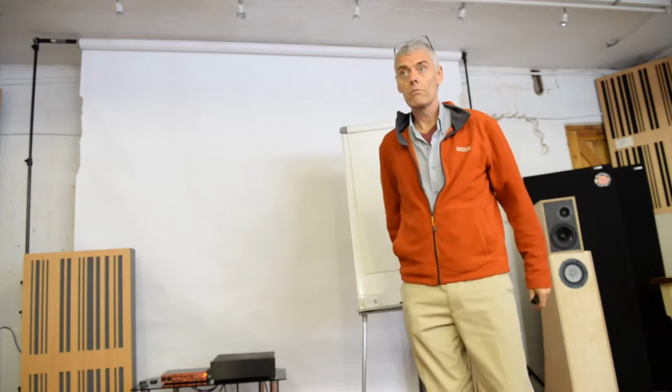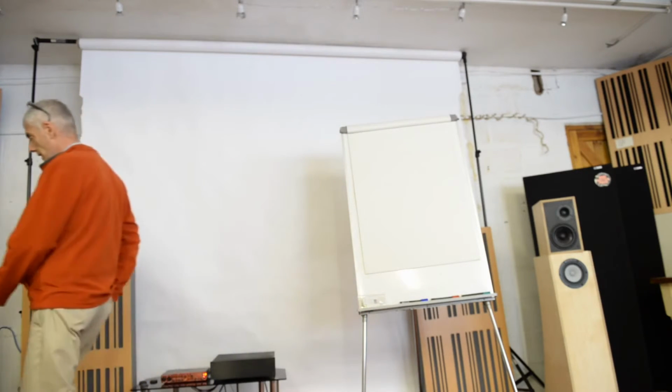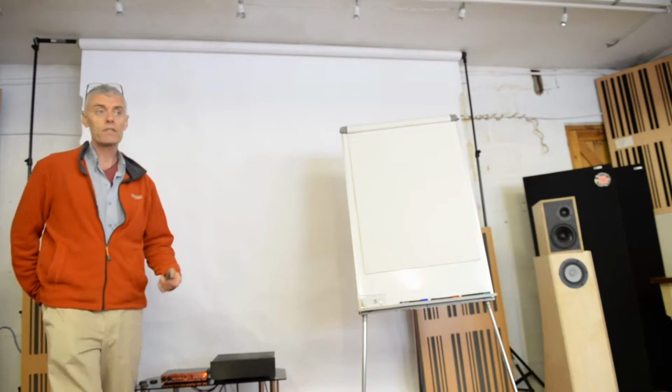Well, I'm not, because in any other industry, cars, aerospace, that's the central hub sub-assembly, and it moves. So that is a powertrain sub-assembly. The audio industry doesn't even think like that. As I said, I'm not from the audio industry. But I think we'll all agree as you pass that round, it is not very heavy. If you were to pull out the powertrain sub-assembly from a 5.5 or 6 inch typical mid-bass driver that you can buy, possibly from Stefan, it'd probably be about twice the mass of that.